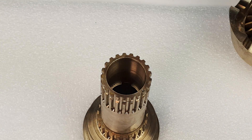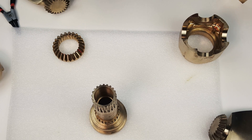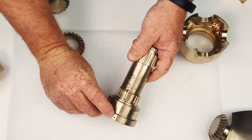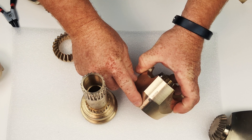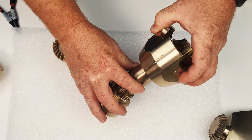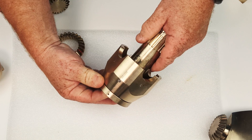And now we're down to the bare bones of the propeller. This is what's fit to the shaft. When you're assembling it, you've got some marks to align. The first mark is on the central hub — this drill mark here will align with the drill mark on the spinner half. Slide the lower spinner half onto the hub, aligning the two parts.